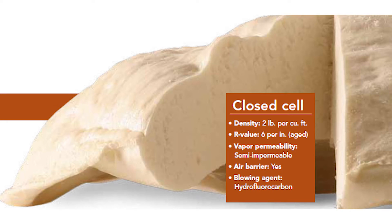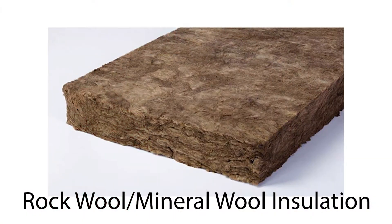As you get farther north, some of that's going to change. You're going to end up with attic spaces where you have a dead attic that needs to be ventilated, and you're going to be insulating in the plane of the attic. For walls, your best option is to again do two inches of closed cell spray foam applied directly to your siding — whether you're using steel siding, OSB, HardiBoard, whatever. This will serve as a vapor barrier because it's not going to let any moisture out, and then you can do batt insulation inside that. I'm leaning towards rock wool now because rock wool is not affected by moisture.